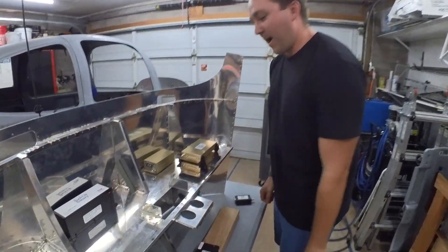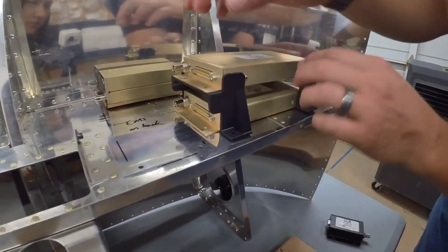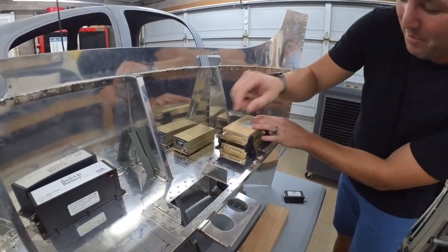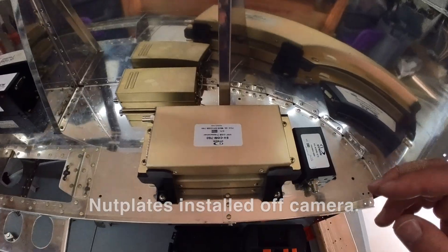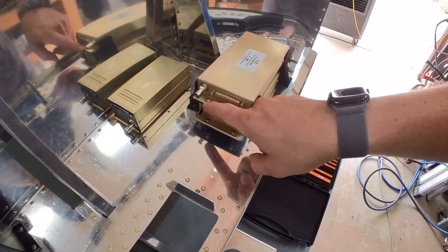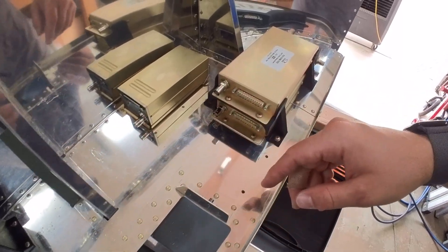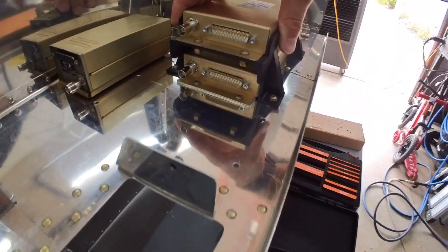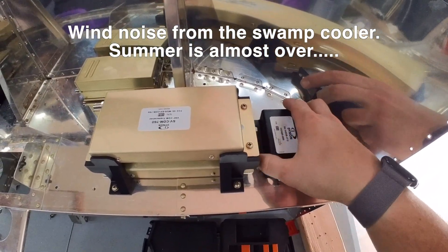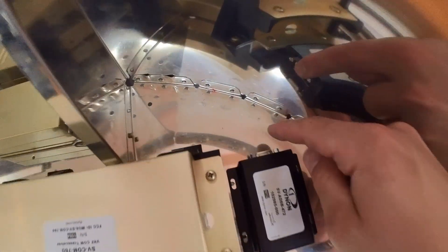Going back to this original setup, I am able to place both of the comm units here. You'll notice I did leave a little relief cut, so I should be able to get in and easily access them. I'm happy with it. I did chat with support over at Advanced Flight Systems asking if I should ground the outer shell of this — he said yes. So I'm either going to run a little loop down and bond this to the outside case, which is tied to the airframe, or run it over to a grounding block. Being able to reach inside of there, it is very sturdy. This should give me enough distance to get the coax over the edge and get the back end of the D-sub into the back of it.